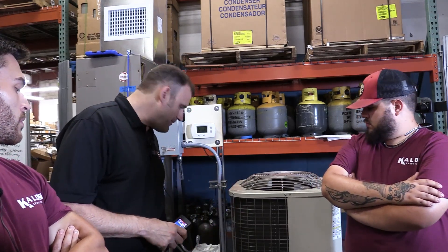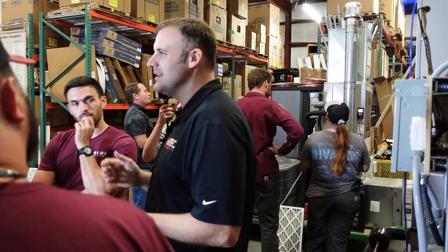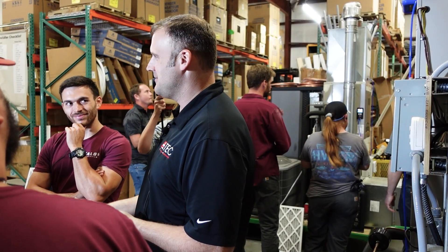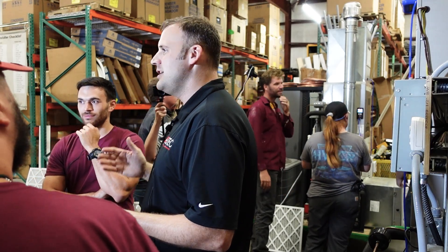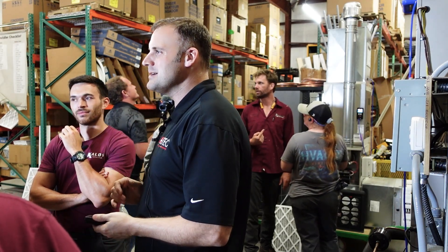Here's a nice application with this tool. Let's step away from the digital True Flow for a second. You buy the kit that comes with the DGA. Let's say you've got a house with a massive master bedroom — huge, two exterior walls, vented attic, a lot of heat coming in. The insulation in the older house is R20 and it's not placed well. You've got two walls full of heat, a lot of glass. And they also have that massive bathroom with a huge garden tub, a four-by-four window, and a massive eight-inch drop in the bathroom. Let's say there's 800 CFMs going into that master bedroom and bathroom combined.